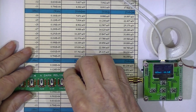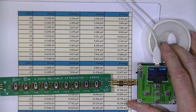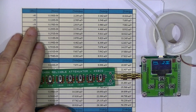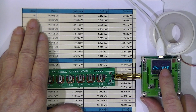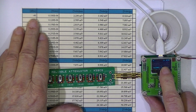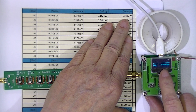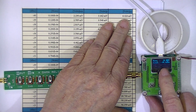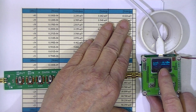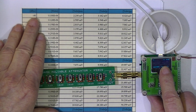I can switch out 10 and switch in another 20, which should put us down to minus 40 dBm. The wattmeter reads minus 39-point-something. That should equate to 6.3 millivolts peak to peak, and I'm reading 7000 microvolts. I'm still within a decibel of minus 40 dBm.